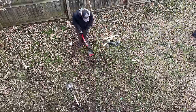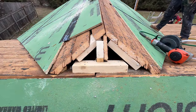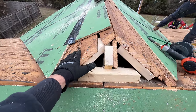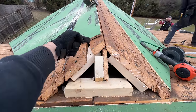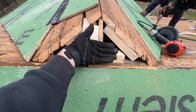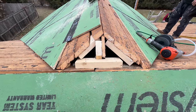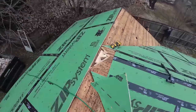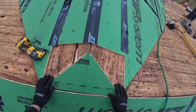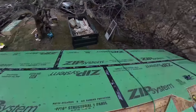I've got this little area framed back together — it's very crude. I didn't even cut angles on most of this stuff; I just needed a way to tie these together to something underneath. I shot nails through these into this little ridge piece, added a little nailer for the bottom part, and took a little bit off with the oscillating tool so everything was in plane, flush, and supported. I think we can put sheathing on it and it'll be great — no one will ever see it again.